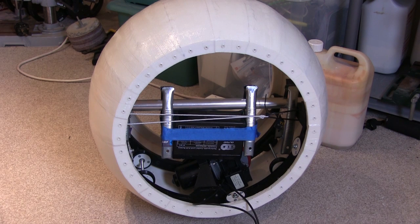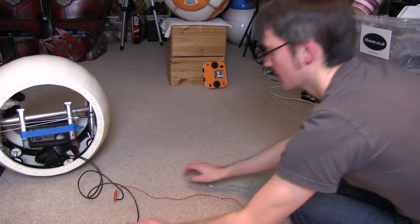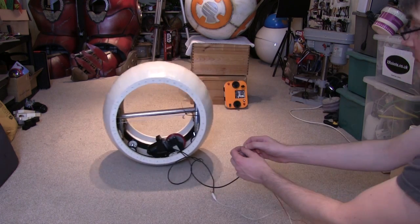I've put the internal hub back in. The heaviest thing I can find at the moment is a lead acid battery, which won't be powering it because they're rubbish — I'm going to use LiPos — but for now it's really heavy because it's got lead in. I've also taken the battery out just to test traction with no mass in it, and it seems pretty good. Obviously that was just me touching wires on a battery; it'll actually be much more stable when I implement dynamic stability with an inertial measurement unit and a PID controller. You can check out version 2, part 2 to see how much more stable that'll make it, but I'm not going to build the control system until all the mechanics are done.